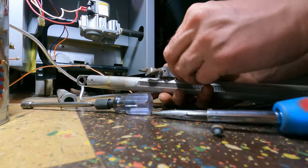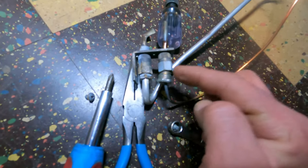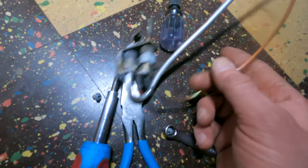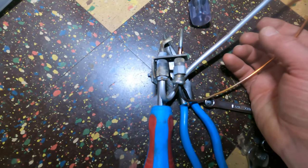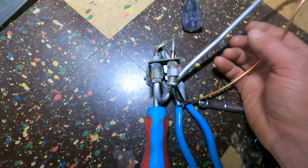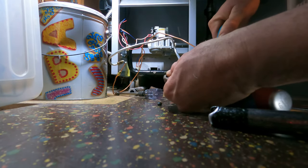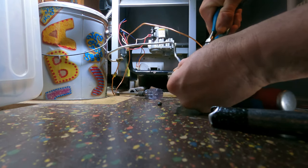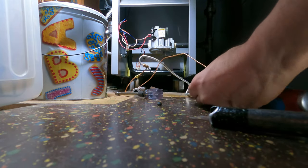Because when you've got damage on the thermocouple, look at how it's threaded in. I'm wondering if that's even going to come out. It should come out, but that's had problems in the past. Looks like somebody used a top clip to help hold it. Whew. Always something. So now let's see how hard this one's going to be to get out. It's cross-threaded, or it just overheated and melted. I've had that happen. Let me get a wrench for that.